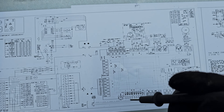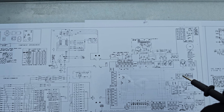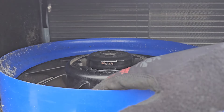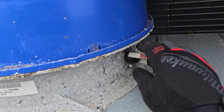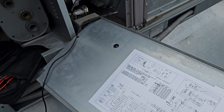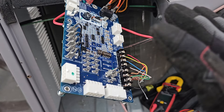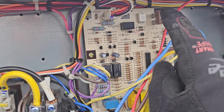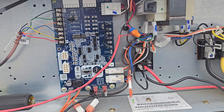If you're having this problem, this video will help you out. I do these videos when I run into these situations so you guys can watch them and be better prepared - you don't have to struggle as much. Basically, this limit switch right here is the problem. I'm going to put everything back together and demonstrate how we lose power to the thermostat's 24 volts and to the ignition control module while that limit switch is open. Stay tuned.